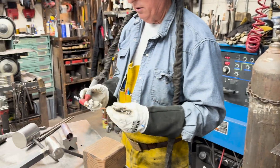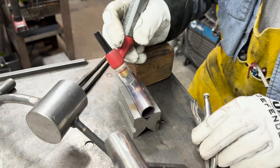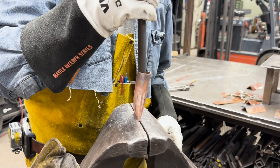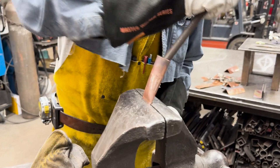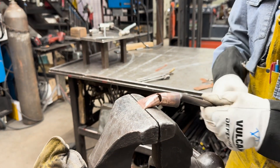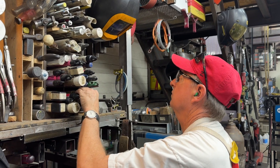So this next weld is maybe 80 to 100 amps. I thought we'd just do a little bend test — let's apply a little bit of pressure to the top. It's not fully welded, it's ground off, so let's just see what it does. Starting to get a little bit of failure — let me tap on it to break it. That was not fully welded, but I think for an artistic project you could fully weld it and it would be strong enough for most things you might do. I've got a pretty good feeling about how to weld copper at this point.